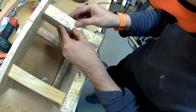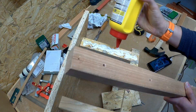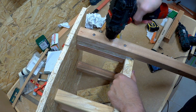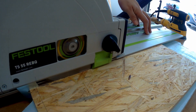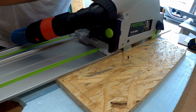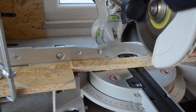I attached the post to the back side of the structure and then moved on to the latching mechanism. Bosch uses a technology called L-Box, which allows for stacking boxes in a similar way to Festool Systainers. I managed to 3D print some hooks that secure to the L-Box brackets on top of the vac. Here you can see me cutting some OSB pieces that help secure the 3D printed L-Box hooks. I've linked the Thingiverse files below — I had to tweak the design a little bit, but depending on the L-Box version you have, it may work as-is.